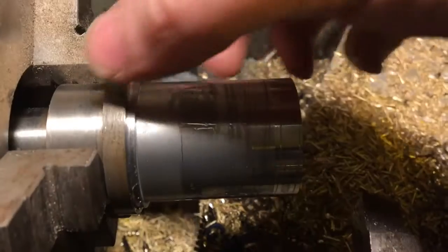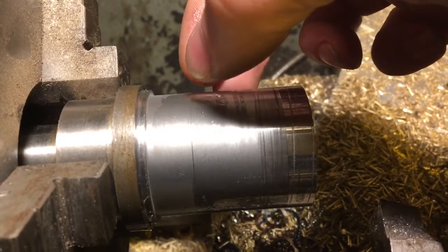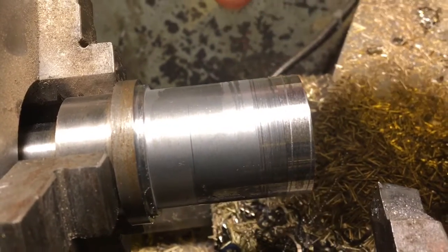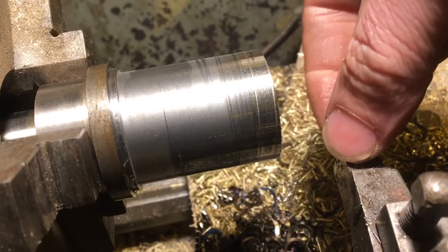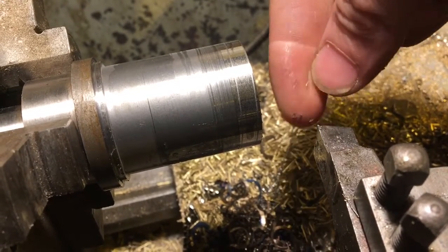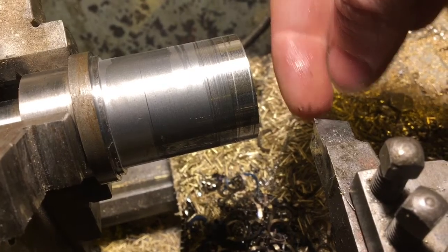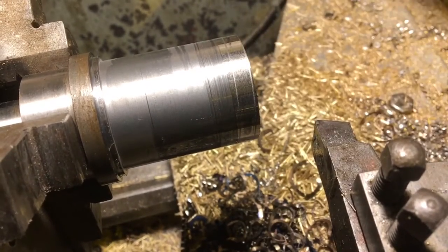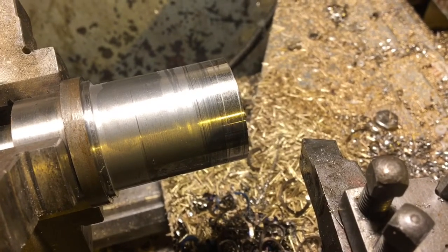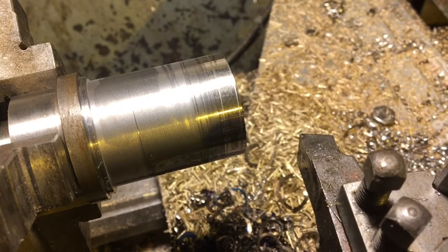Maybe this test is a little bit flawed. What I can say is that high-speed steel, whatever cut you take, if it's sharp, it never tears and leaves a fuzzy grey finish - it gives a nice finish. The benefit of high-speed steel for me over carbide is that I can take a light cut and get a good surface finish. If it's honed and sharp you can wear a few tenths off. With some of these carbide inserts, a light cut just won't be consistent or what you want. We didn't prove the point I set out to prove, but I hope that's of interest to someone - don't forget to like, share, and subscribe.